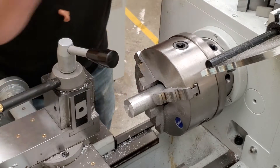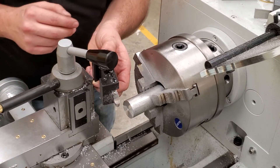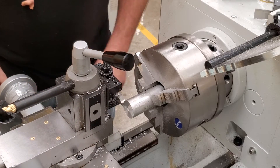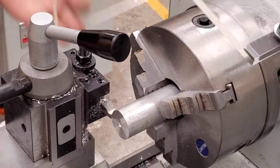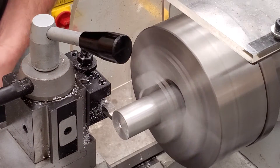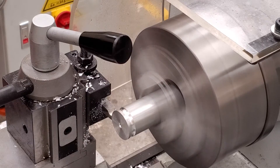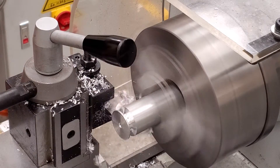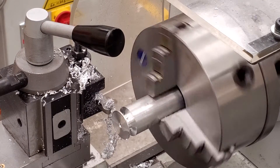Remove the quick change tool here. Next, we're going to install this one that has a curve on the end. We have 2 different curve sizes — there's this one and a larger one. We want to use the small one. Install that and tighten it up. Get this lined up. How deep you go is going to be personal preference depending on how you've designed your project. Go in slowly. If you're getting a little bit of chatter, I probably need to sharpen the bit.